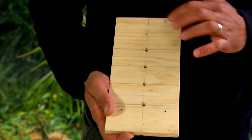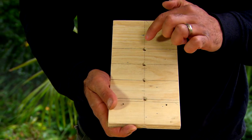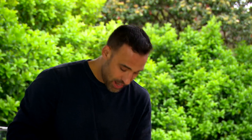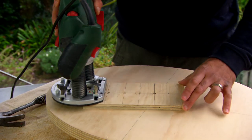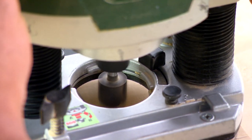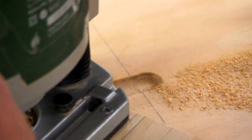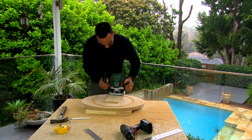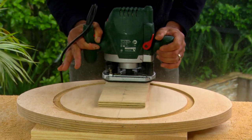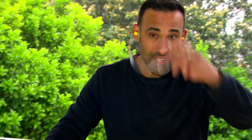For the maze I've just made up this jig. I've marked out the center line and I've got equally spaced holes — those holes will line up with the center of my board. I'll mount my router with the bit lining up with my center mark and then trace that around. I'll move to the next hole, repeat the process, and that will give me equally spaced circles for my maze. Even though it's only around 5mm deep, it's a good idea to go around at least twice, so adjust the depth down as you go.